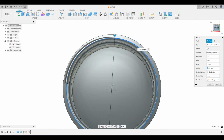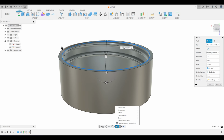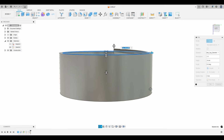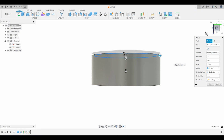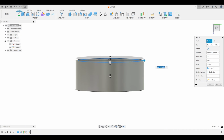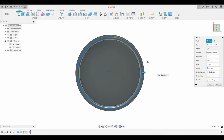Let's go up to this bottom view here. Actually, let me backtrack. It's really important. If you go down to your display settings and camera, you want this to be at perspective with ortho faces. And this is what this means. Let's just go to perspective here. And when we're out in 3D space, you're getting the perspective. And if you go to one of the faces, you're still in that perspective. So you see how this is rounded here and this is rounded up here, because we're still looking at a 3D image. If you go to camera, perspective with ortho faces, do you see how it squares off here? Whenever you're in one of these bottom, top, left, front planes, you get shown a 2D picture instead of a 3D picture. That's really important for these sketches that we made here.